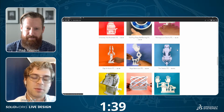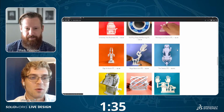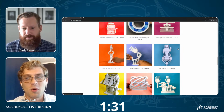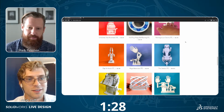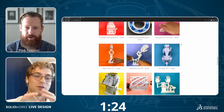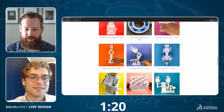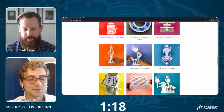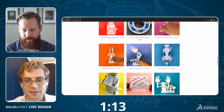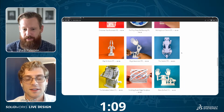Typically when you're working with an Ultimaker hobbyist machine, you're working with PLA plastic, so it's going to wear down. Even if you print with 0.05 millimeter, eventually it's going to open up to 0.2 millimeter, so that friction fit may not be so friction tight anymore. Sometimes I'll make these things and it's either way too loose or won't move at all, and I could never get it right. So you think just 0.2 millimeters is the right tolerance for that?